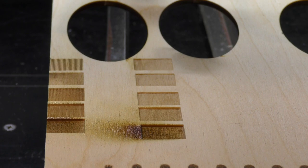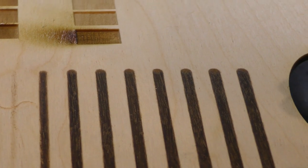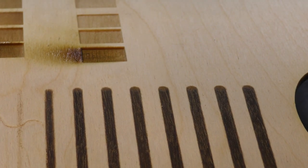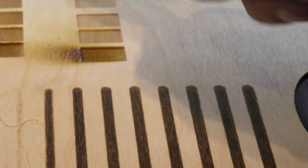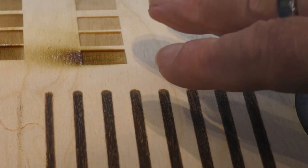I can only show you these very simple tests, the elements of what cutting and engraving is all about. The only thing a lens can do is cut. You can make a lens cut softer by defocusing it. You're trying to make the beam so soft that you scorch the surface, as we did here, rather than cut the surface. Even though your diode laser might not be very good at cutting, it still has a cutting lens on it. And it will go in by a small amount and produce these sorts of effects. You don't remove material unless you physically evaporate it. Now, I'm not going to go into the technology of how light evaporates wood.